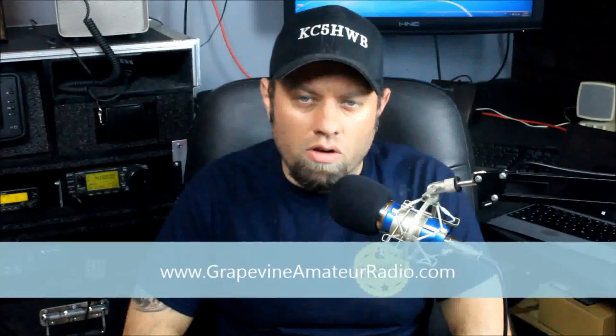And I'm a 220 fan. I talk on 220. I talked on 220 driving home from work three days this week. I talked on a 220 net — there's a 220 net on Friday evenings at 8 p.m. If you're around the Fort Worth area, it's on 224.78 with a PL tone of 110.9, run by a couple of guys out of the Mansfield Club. It's a good net — they usually have anywhere from 8 to 10 to 15 check-ins. For 220 on a Friday night, that's pretty darn good. So 220 is really coming up in this area. I talked on three different repeaters this week alone on 220.